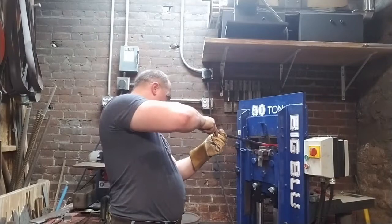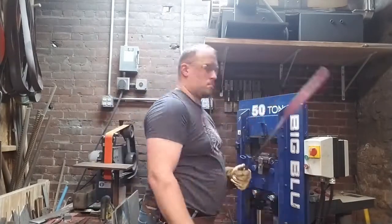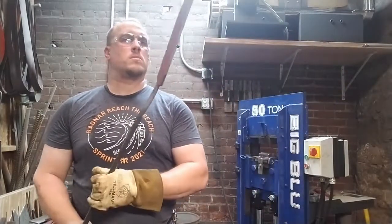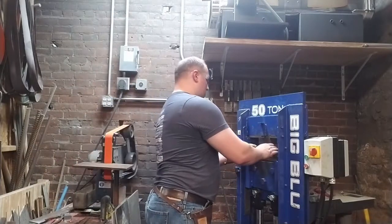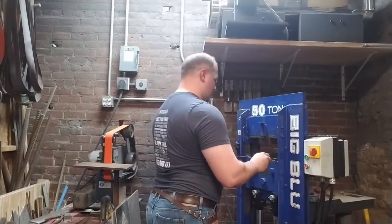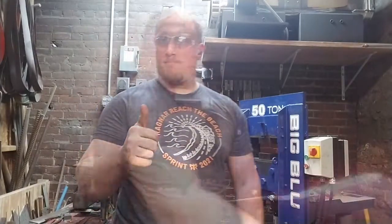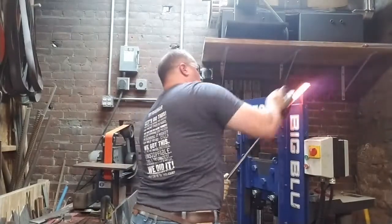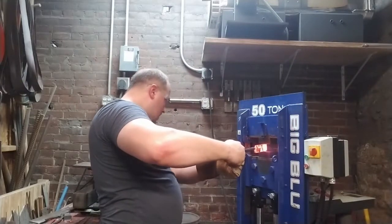You might say, well, why not just use two flat dies? And that is more gentle on the welds, but actually the sharp faces of my flat dies will cause bumps and ridges on the face of my surface, and can cause cold shuts. That's really just a function of how those dies were made. But they're very good dies.